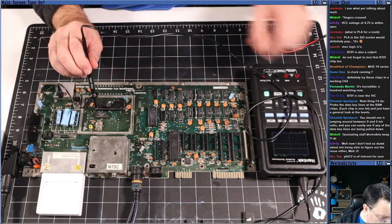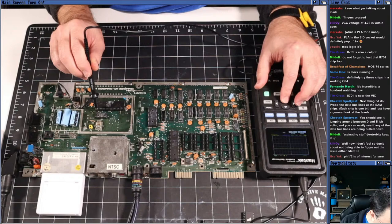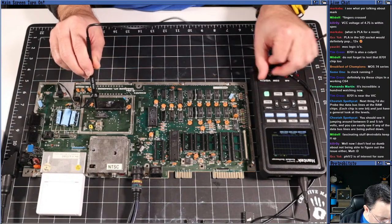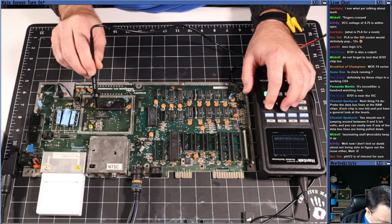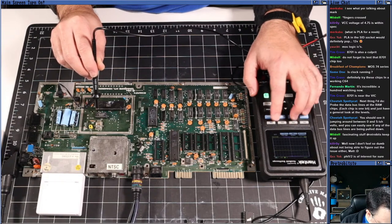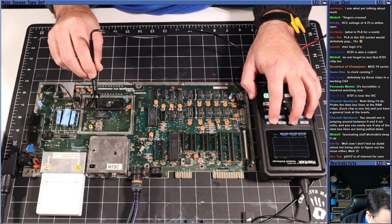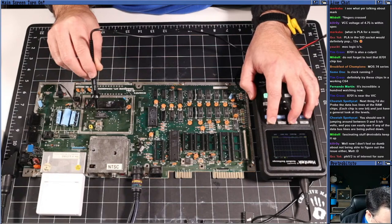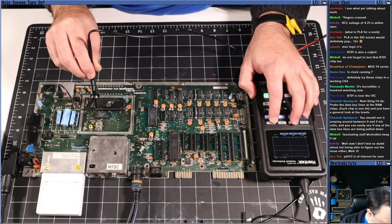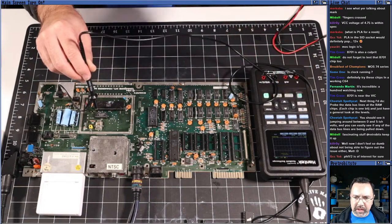All right. We've got a little ripple here. Let's zoom in. Let me change the time here. We have 50 nanoseconds, 20 nanoseconds. That's a smooth line there. Let's turn on the settings, the measurements. Okay, we want to do the frequency measurement. We want to look at the peak to peak. 320 millivolts. Okay. Peak to peak, 320 millivolts.